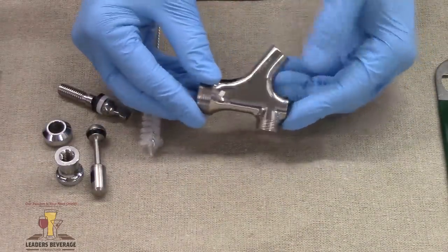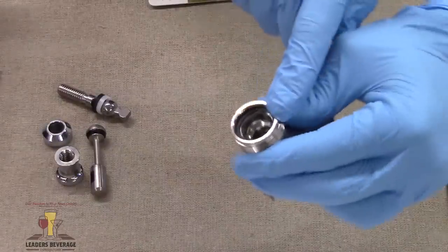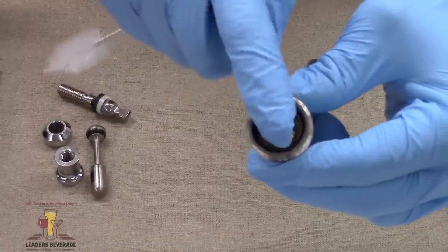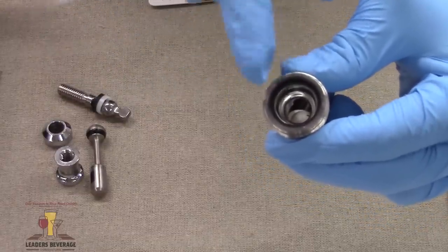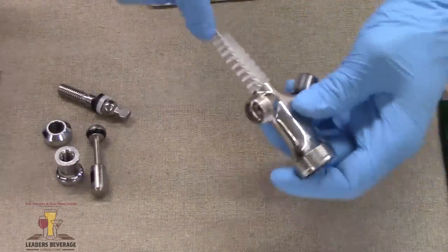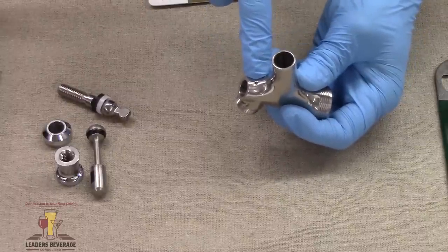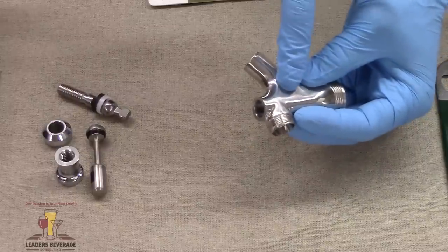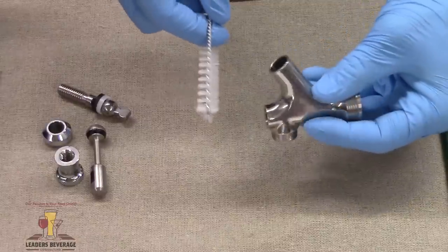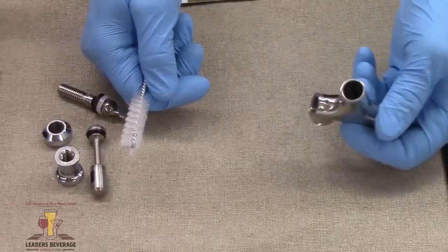Then we come to the shaft body. We're going to clean it all and inspect the faucet washer — you can see there's a washer in there. Make sure that washer is nice and clean with no breaks or frays, because that will cause a lot of leaking too. Use your nylon brush and go through the bore and down the shaft and through the top. There's a vent hole here, and another vent hole inside that leads to the interior. Those vent holes need something small — sometimes you can get the nylon brush in there, and sometimes you'll need to use a dental tool or something. Nothing that'll break off in it though.